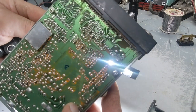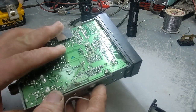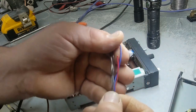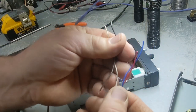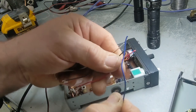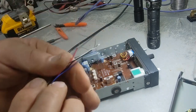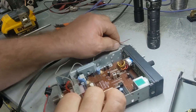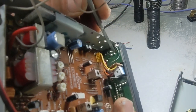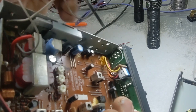That's where I drilled the hole for the wires to come through, and I didn't hurt it. All right, let's get some wire and wire this up. I went and got a parts radio and I've got wire — white and black, kind of like speaker wire colors. Red for transmit, black for receive, white for audio, and blue would be ground — your shield. So what I'm going to do is strip these, get them ready to solder. I'm going to solder them on. All four of them are actually all ripped off the board, so I'm going to make sure they're not shorting out and solder those to the board.